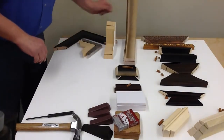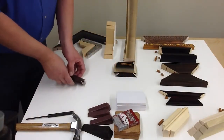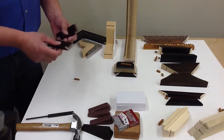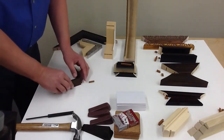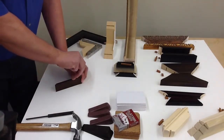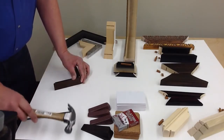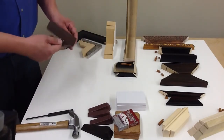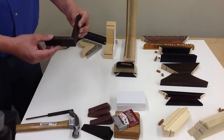Put this over here. Next we come to your shadow box material. Also the thin, fairly delicate little frames, again with the flat front. Same assembly here, glue on both sides. Dovetail key, this time we're using our W1, the smaller keys. And even material as thin as 5/16 of an inch, we can still join with the dovetail key, and you'll see a nice tight joint here.